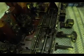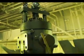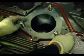Turn the crankshaft to a position where the tappet roller of the fuel pump may rest on the base circle of the fuel cam. Remove the connections required to take out the fuel pump. Screw the lifting tool on the fuel pump and with the help of a chain block take it out.